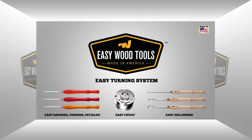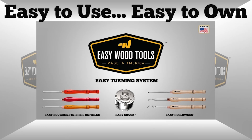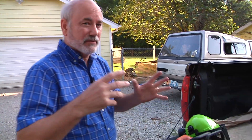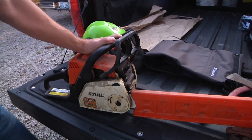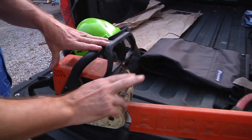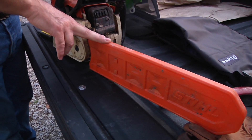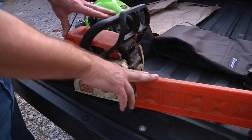Easy Wood Tools, best in class carbide woodturning tools. It has been a long time since we've cut down a tree, so I want to go over a couple basics — you need some equipment when you take a tree down that are very important to have. You obviously need a chainsaw, and you need one with a blade long enough to attack the tree you're going after. The one we're going after today is about 12 inches in diameter, so we're good with a 14-inch chainsaw.